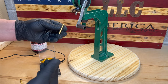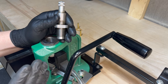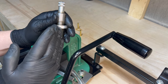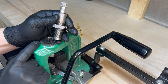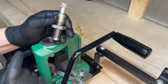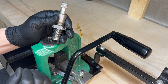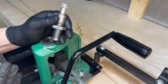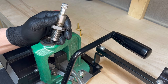For the bullet seater and crimping die, I want to take a moment to explain it because this is where I get about 99.9% of my questions when it comes to reloading. There are three main components: your locking ring, your main body, and your bullet seating plug. The main body has two functions — to stabilize the bullet seating plug and to provide the crimp. The bullet seating plug actually pushes your bullet into the case. I'm going to first show you how to bullet seat only, and then we'll work into crimping.